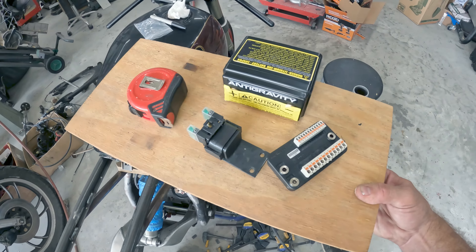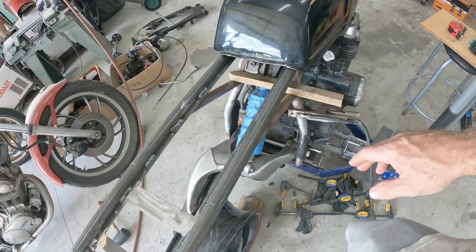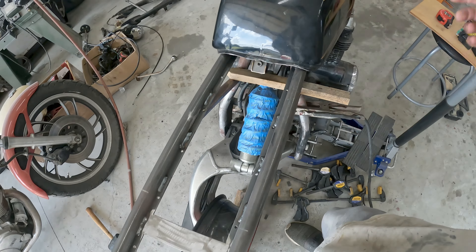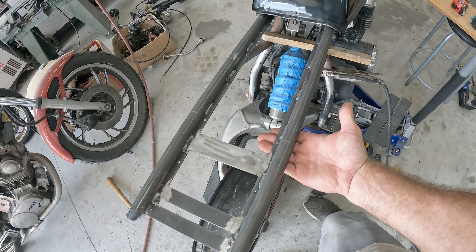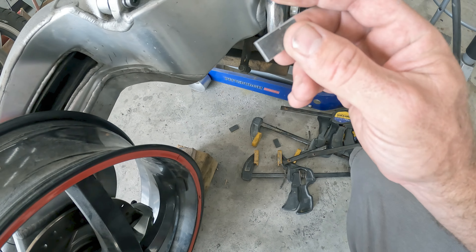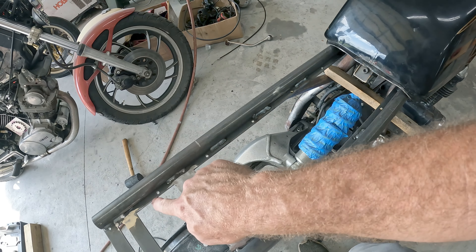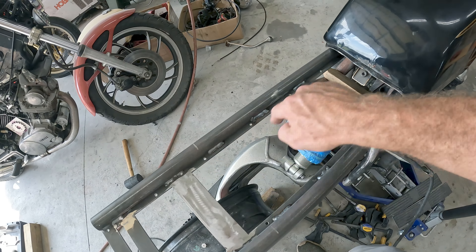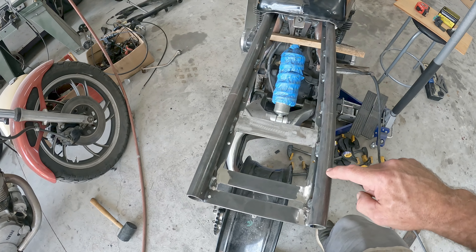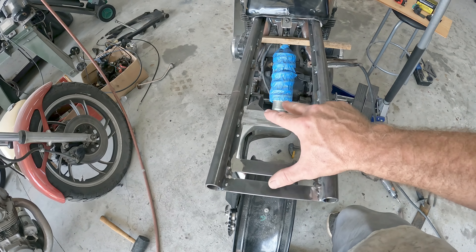The tank is back mounted. What I did is I clamped a piece of plywood to the bottom side of the table and trimmed some small spacers, putting those underneath this plate here so I could tack weld it into place. These were already pre-drilled and ready to go. If you remember from the last episode, I had a piece of one-inch round tubing notched and fit in here, but I decided to take that out to give me plenty of room for my electronics.